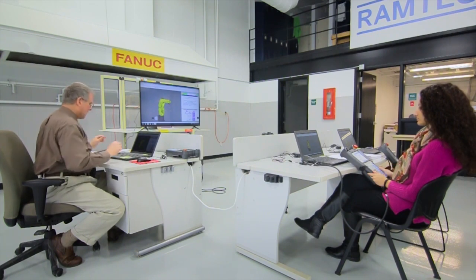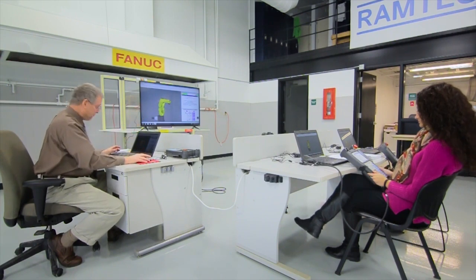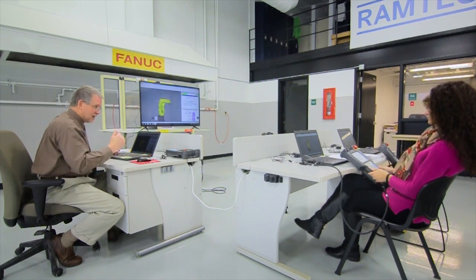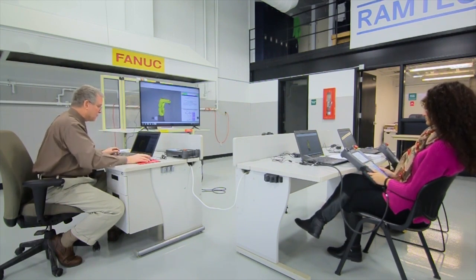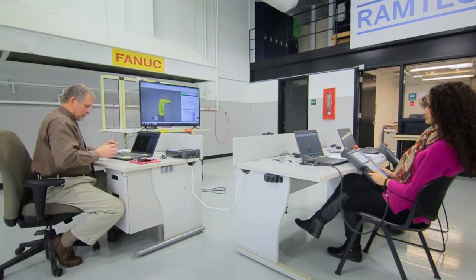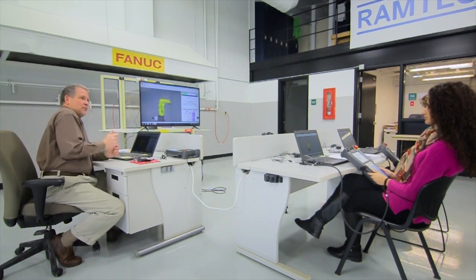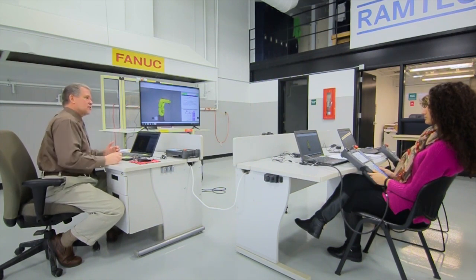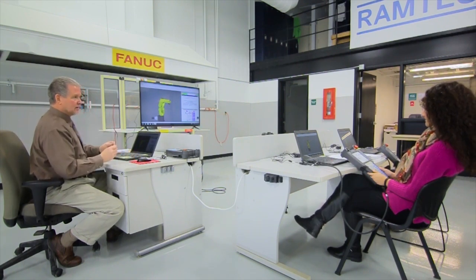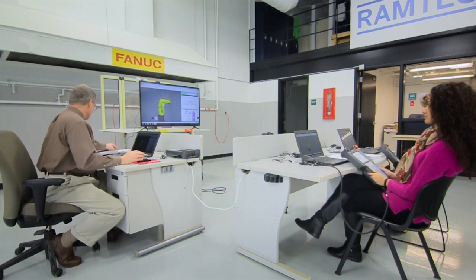Here's a shortcut: on your teach pendant, press Shift and then the up arrow key. It gets out of Fine and Very Fine, then goes up 50%, then leaps all the way to 100%. That's really handy — if you start at 10% default speed and want to get to 100%, you don't want to sit there in 5% increments. Simply hold down Shift, tap it a couple of times. If that's too fast, tap it back once and it goes from 100 right down to 50%.